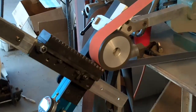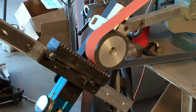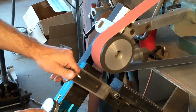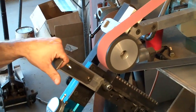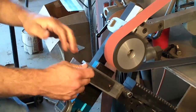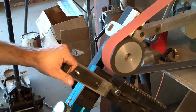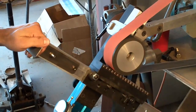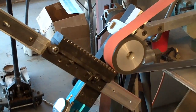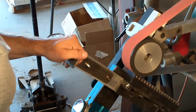I'm going to make a full pass through here — just make a little cut. I haven't really begun touching it yet, barely touching it. Since I've just started barely skimming the table, I'm going to zero this and take off about ten thousandths. I'm going to track my belt over a little bit just so I can see. That's about three thousandths... four and a half... five point six... six, seven... seven and a half... getting close to nine.